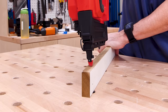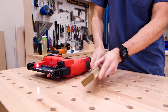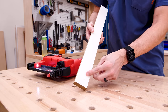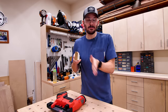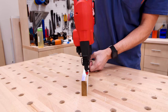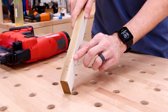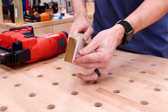I'm going to move to the center and do the same thing even at an angle — it will probably not come out. As long as you're going into the center of the board, even at an angle versus going over even just a little bit, you can save it from poking out. But even if I keep it vertical, if I'm at the edge of the board, the grain direction might still push that nail out. Shooting vertically right at the edge — it just came right out because the nail is following that grain and wanting to shoot out.